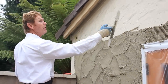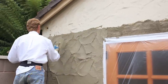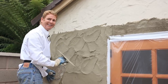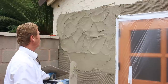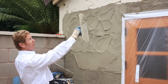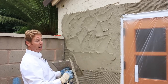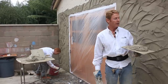I'll look at a wall and see where they left a big clinker, and you say well, that's way too rough — even rougher than what they have. But this has to set, and then when we use a green sponge float — I'll show you that part too — that's what's going to soften this up a bit. I can't match that finish with just a trowel. I need to soften it up, so I'm going to spread this out, and when I get to the green sponge floating stage, I'll show you guys.